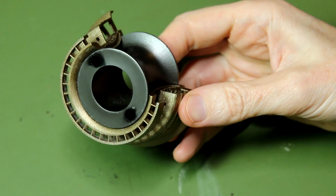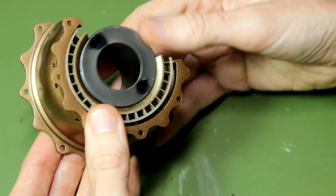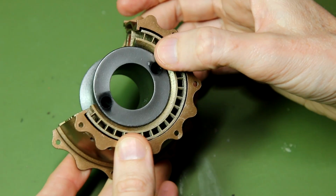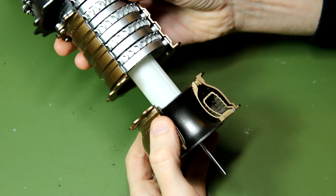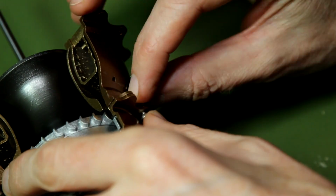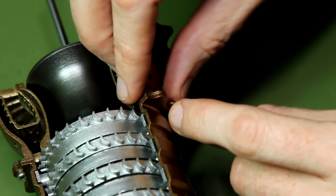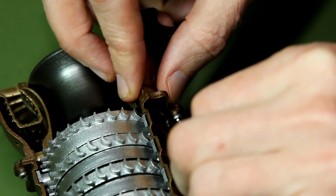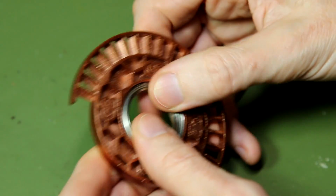This is the combustion chamber. Again, we have those sort of limiters there at the end of the cutaway section to make sure the internal section goes into the right spot. Lots more nuts and bolts. And a very similar process once again for the low pressure turbine shaft.